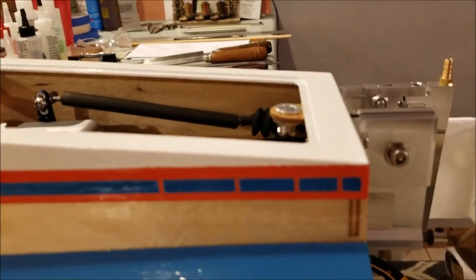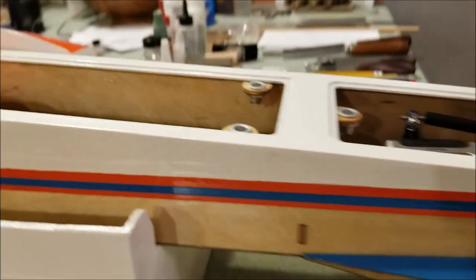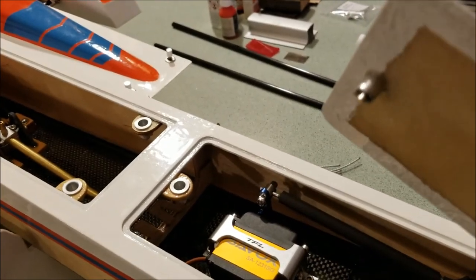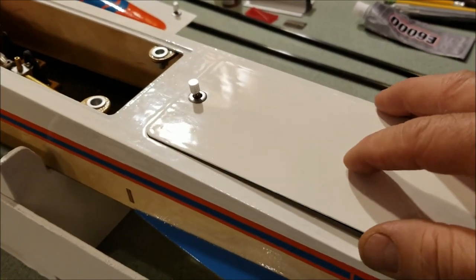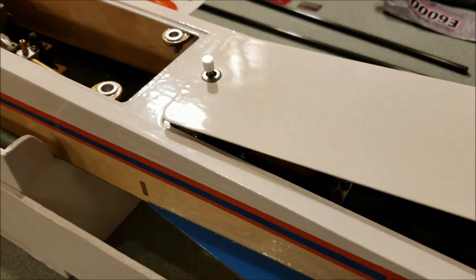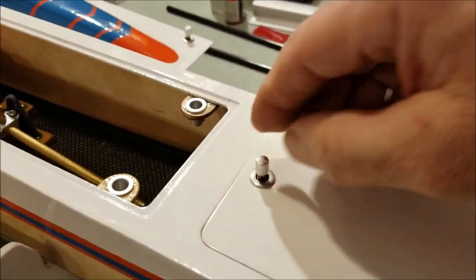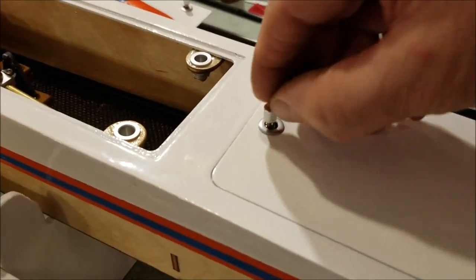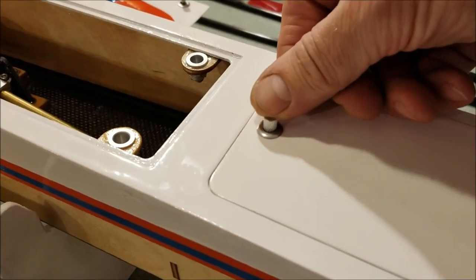With these latches, it's very critical to get them square. Here's two reasons why: the male part that goes into the female part — if it's not square, it'll bind. It's a close fit; you can even see where it binds when you pull it off crooked. The other part of it is that if the piece down inside is crooked, this knurl will actually bind on the ID that goes in. You can see how it's nice and free when it's square.